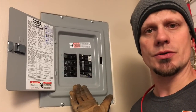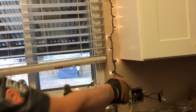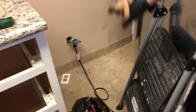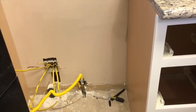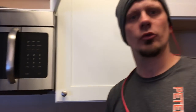Looking at this panel, I'm limited. As I talk about the three videos on this, I want to cover the panel space and what we had to do. When I traced this one circuit, it went to here, then jumped to here, then switched and looped to the garbage disposal. Then it came out of that double switch, went downstairs to the washer, went from the washer to the fridge, then back out of this box up to this outlet here, down to that outlet there. And then instead of a vent hood, they put a microwave and ran new yellow cable tied into the old cloth cable, ending it here.